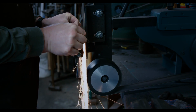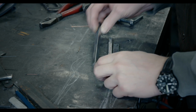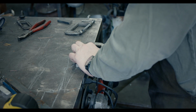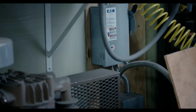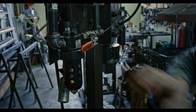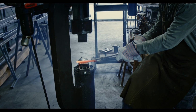Prior to forge welding, I need to clean up the broken spear. For the weld to be successful, the bars need to be square to each other, straight and clean. When clamping them, the bars bowed out, meaning they would do the same when hit by a hammer, so something was wrong. Upon further inspection, I noticed that the wrought iron was forged to a diamond shape, which needs to be corrected. By hitting the bar on the long diagonal, I can forge the wrought iron back to square.